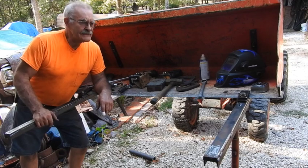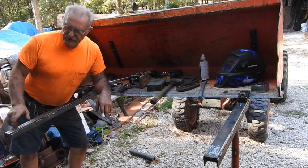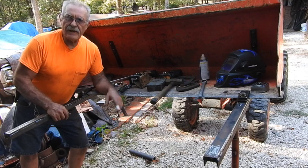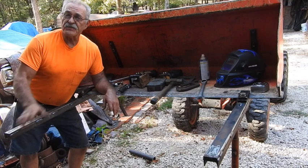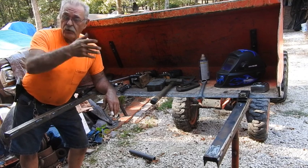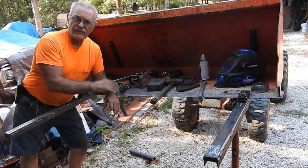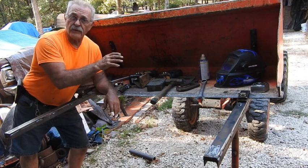We've got a set of light duty forks now. I'm not going to put the angle on underneath for a stiffener because I really think that this half-inch plate across the top is increasing capacity to where it's going to go beyond what the lift will lift. If they bend, I'll just do something different. If you haven't noticed in other videos, you will notice as soon as I start using this for its intended purpose that my bucket is twisted. I knew it was twisted when I started this project - I just have not had time to take the bucket off, weld it down to a bench, cut some slots in it, and bend it back and brace it to hold it perfectly square.